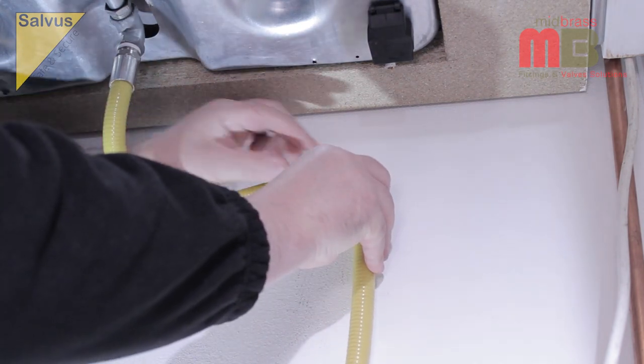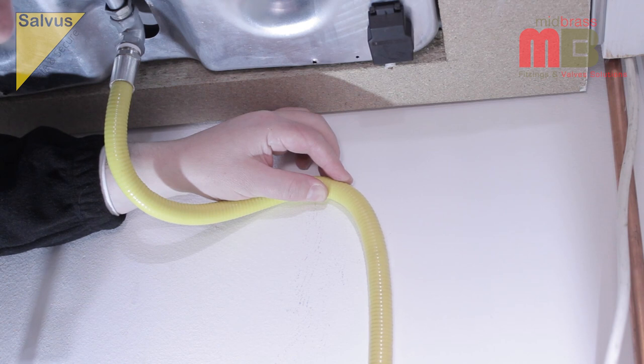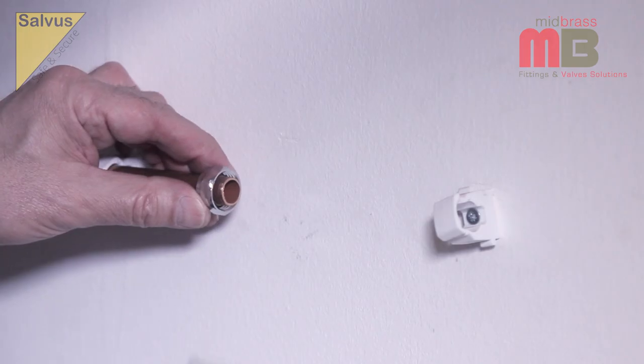Manipulate and shape the Hobmate to run along a suitable route, ensuring effective clearances are maintained to any electrical services and sufficient rear distance is allowed for any oven to be fitted under the gas hob. The Hobmate allows you to easily route clear of any rear oven obstructions.